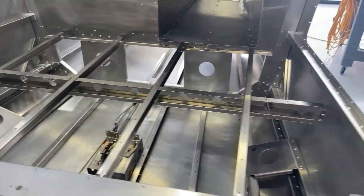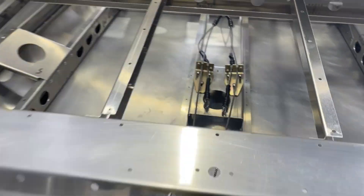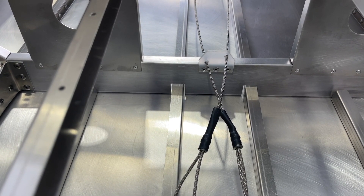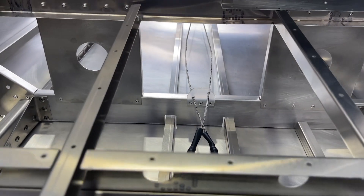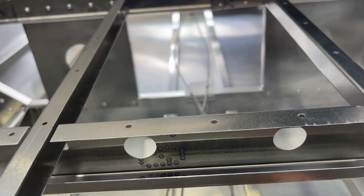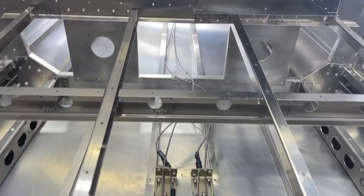Taking a look at the Fairlead here — you've got one that's higher than the other. That's just to keep the two from interfering, because they do cross when you add tension to the rudder cables. You can't see it now, but they do cross, so one's higher than the other so they don't rub.